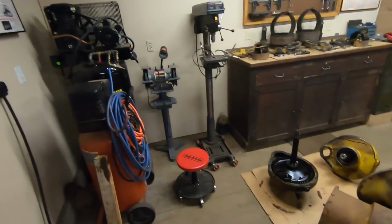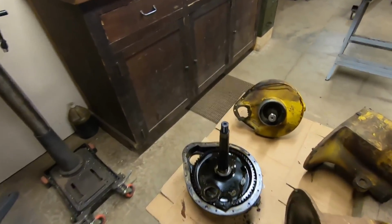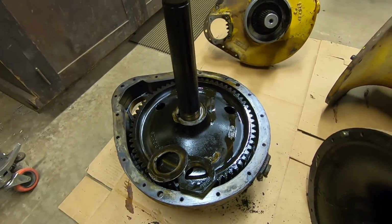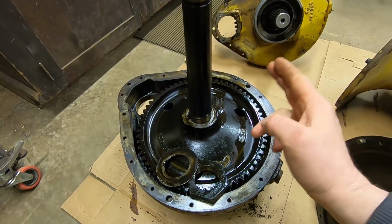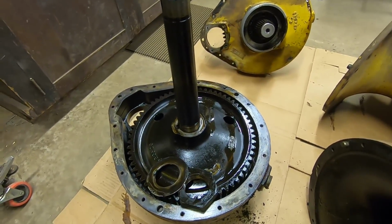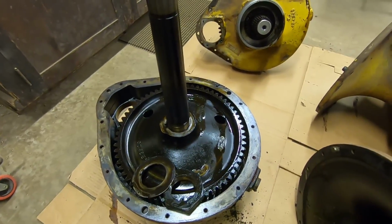It starts giving way before the cylinder maxes out, and I was hoping it wouldn't be that bad, but I'm really not that surprised because these bull gears are like the tightest press fit on a D2. I believe book spec says 25 tons. And I'm pretty confident that the last person that assembled these pressed them on at 25 tons. So, you know, I've just never really been set up to handle a press fit that tight. So we're trying to remedy that.